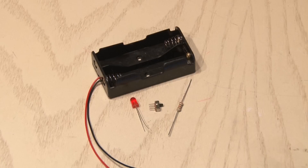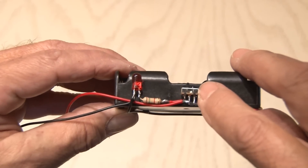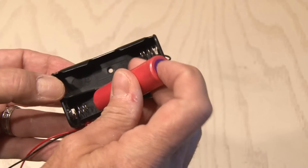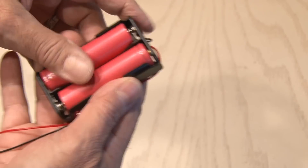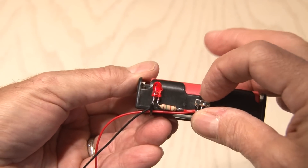The glove is now ready for our power circuit. We're going to build that using the battery holder, a 1.5K resistor, an LED, and I also included a small switch to turn it on. I glued the switch to the side of the battery holder, and have the resistor and LED, which will indicate power when we turn on our heated gloves. Now I'll add my batteries to the battery holder, flip on the switch, and our LED lights up to let us know we've got juice.